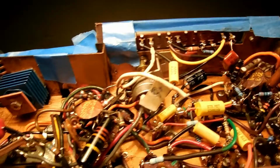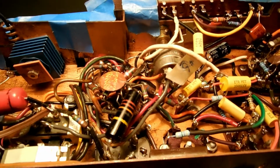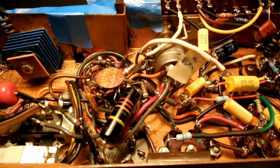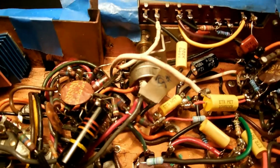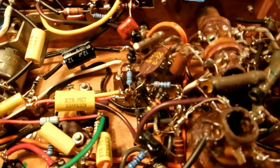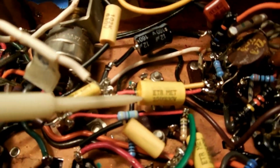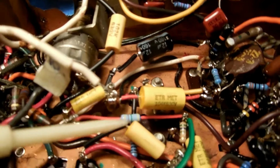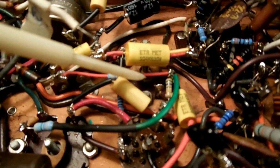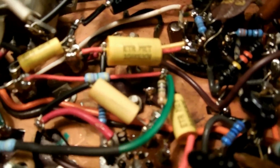Thanks for watching. Wanted to go over a little progress here on the Trans-Oceanic. I started February 16th, it's March 6th. Actually, February 15th, it's March 6th. Replaced the components as necessary. I also took out and dismantled both of the IF transformers and cleaned the capacitive discs.